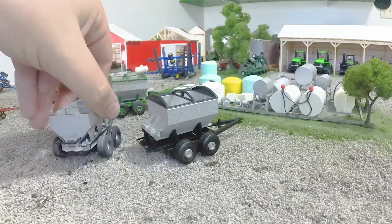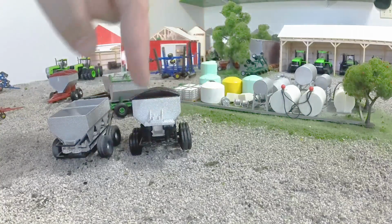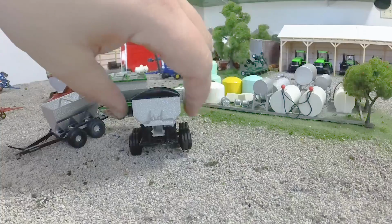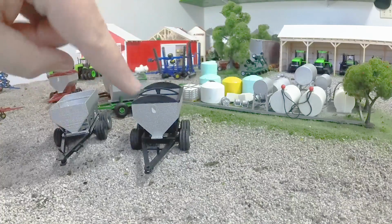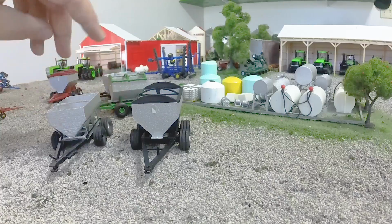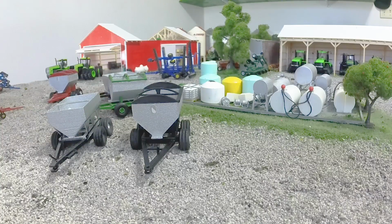Now probably the other difference is this gets some support beams back here in a couple spots, as you can see, where that's unnecessary on the 4-ton because of the smaller beaters. And then on the front, I put in a window for viewing through the tractor, so you can hopefully see what you're doing, where on the smaller one, you'd have to get out and see. Now, a good fertilizer operator, you can tell when you're out. One, the tongue weight gets really light, and then you can hear it hitting as long as you don't have your radio blaring. So, it's not a big problem, but I've always thought on our real fertilizer buggy, a window would be great. So, okay, that's kind of it.